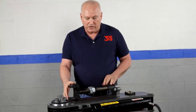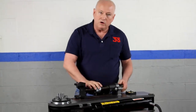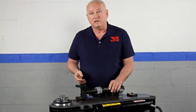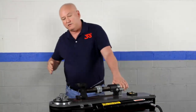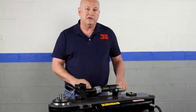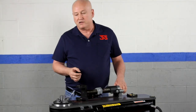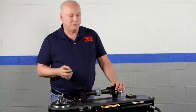We also have two adjustable nuts here that let us set exactly where the pressure die sits under bending load. This allows us to work with future accessories currently in development, such as a mandrel extractor and tube feeder, which require tubing to come in straight from the side of the machine. You can infinitely adjust it. It also makes custom dies very easy to produce — so you could call up needing something like a 6.17 inch radius, and with this system it's easily and affordably made.